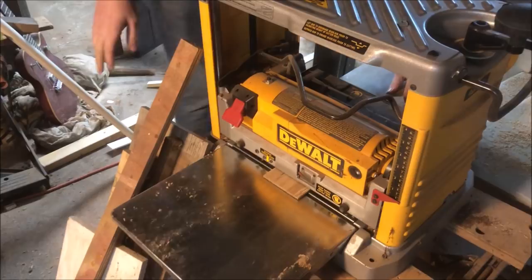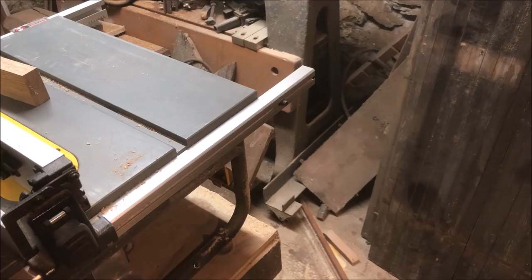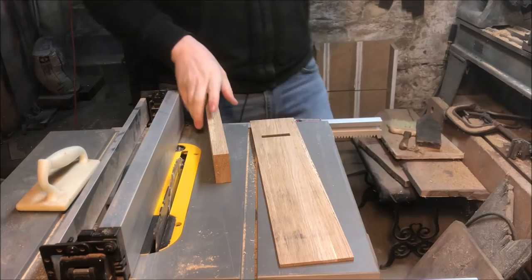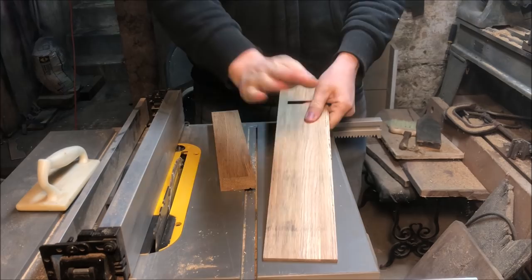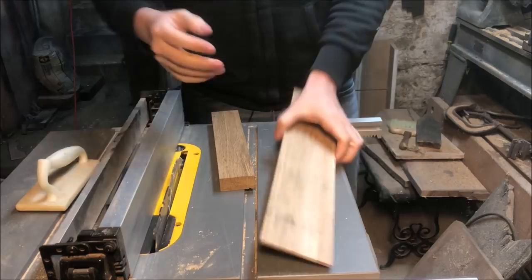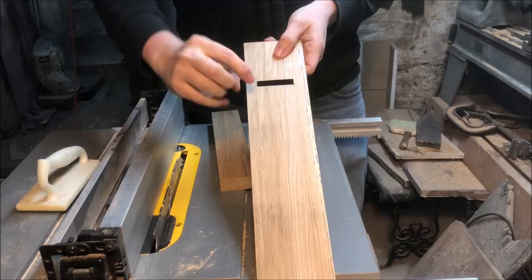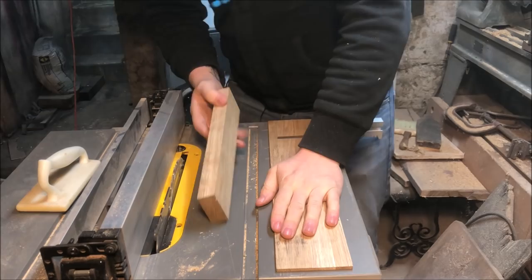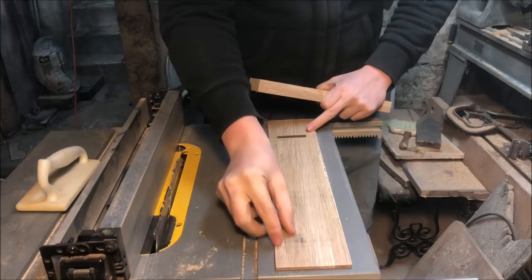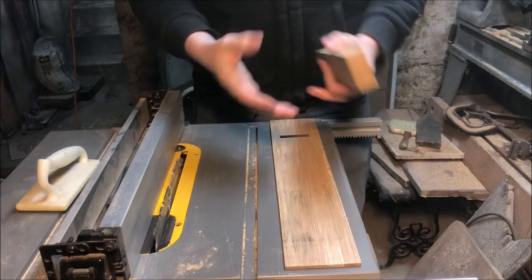Let's get that sander. Now I've got to figure this out — these pieces are pretty good, but they have to hold the weight of my foot over a relatively uneven surface. Eventually they will flex, and that does not make for a good hand plane. I needed it thin because the blades aren't long enough to go through a very thick piece the way I've designed this. So it has to be thin, but it also has to be strong. To make it strong, I got more wood and I'm going to make rails — spines along the sides — to add some thickness and stability underneath my foot so it doesn't flex as easily.